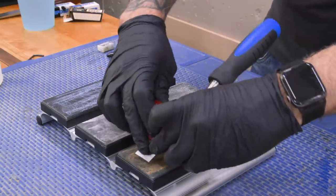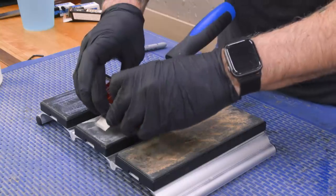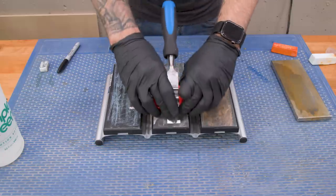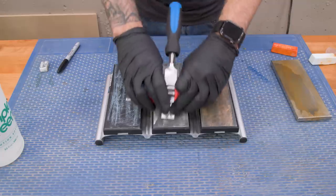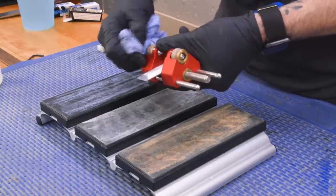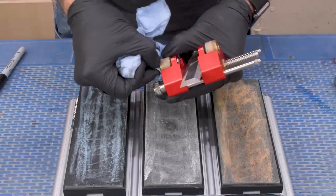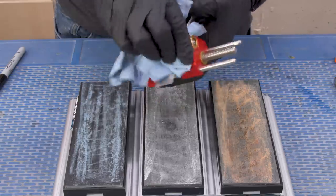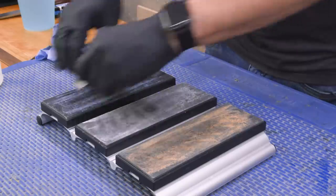It's looking pretty good. One thing to watch out for when using a honing guide like this: my honing guide is picking up some of the compound. Freehand is not that hard, especially if you're just doing the stropping freehand — it's not difficult to do. I probably should just abandon the honing guide, but I want to see it through at this point. Truthfully the stropping is just meant to be quick and dirty on the leather — a couple passes and you're done.